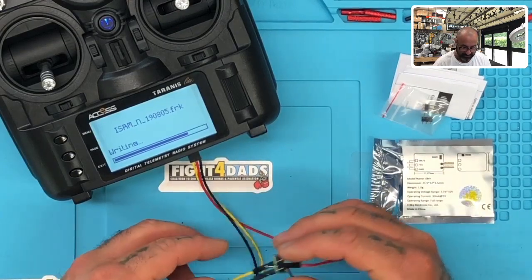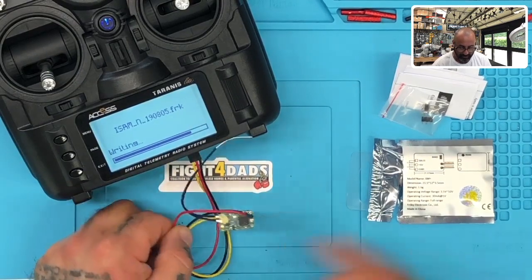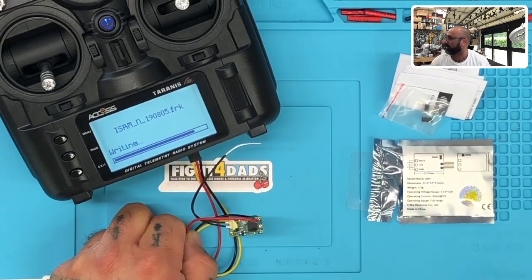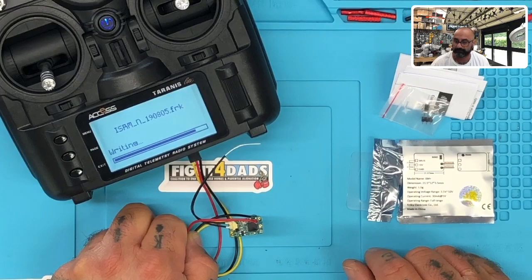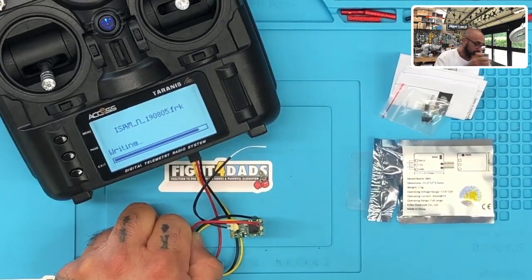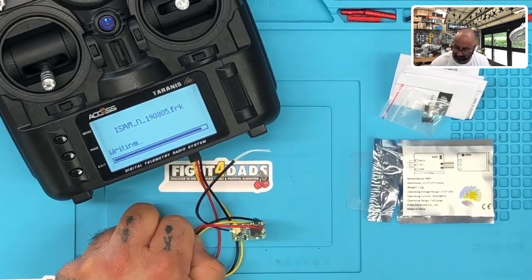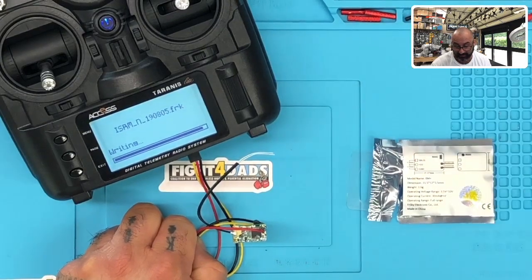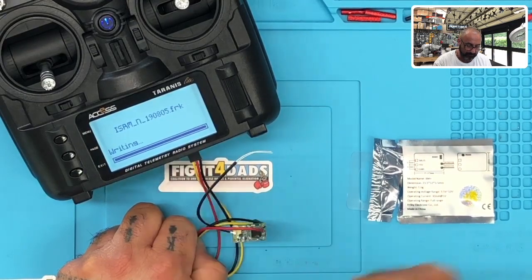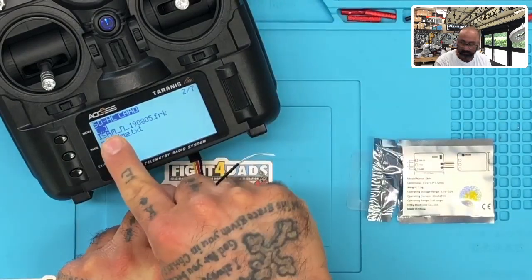We want to update this using the update cable. On the website I've given you a link to that — it plugs into your radio's three pins and the receiver. As long as you haven't soldered the receiver yet, the pins fit right through the holes. Put ground in one up, the second one down, and the third one up — the tension holds it in place. Now let's wait for the internal module flash to finish writing.